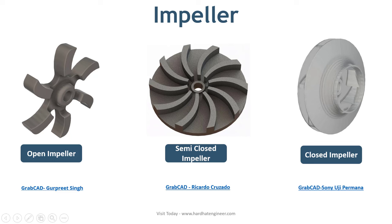There are three basic impeller designs available, as seen in the images. The first is the open impeller — the most simple design, where the vanes are open on both sides. Due to this design, it is structurally weak compared to the other two types. The open impeller is used in service with particles and can also be found in cheap, low-duty pumps.